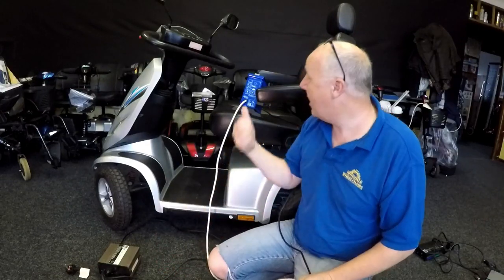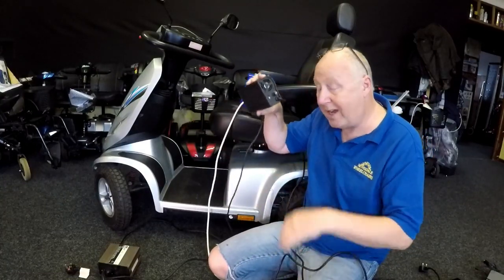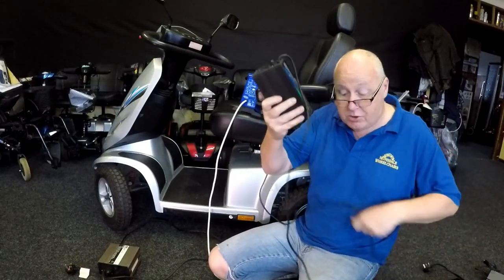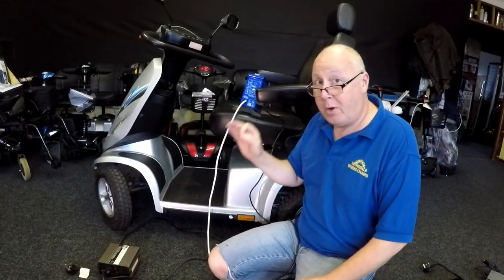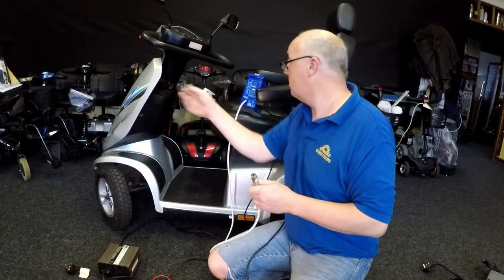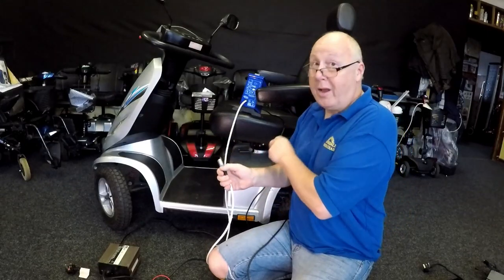The reason for that is these chargers are programmed a specific way — they won't work until you've got a specific amount of voltage being put into the charger, not what the charger's giving out. So if you've got no voltage, or let's say 8 or 10 volts, the charger won't work. Your electrician comes along, checks it, says no power coming out — you need a new charger. So many people have phoned up: new charger still won't charge. The problem is you'll most likely have low voltage in the batteries.